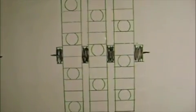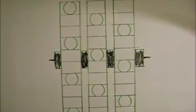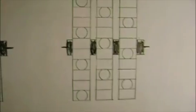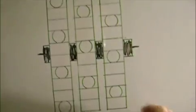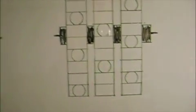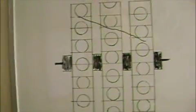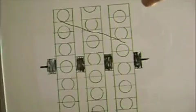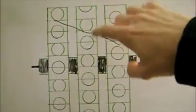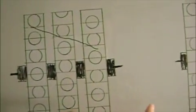I'm guessing that as Mike Brady changed the design, he did this as a way of trying to get past problems he might have been having with the deterioration of the magnets — adding these spaces might have helped. Also, these are bored out at 30-degree angles, so they don't come out straight at you. The distance between each of the different rotors — you don't want to get them too close together, because then you're going to run into flux problems with the magnets from rotor to rotor. It doesn't really hurt how far apart they are though.